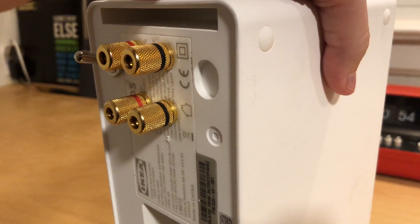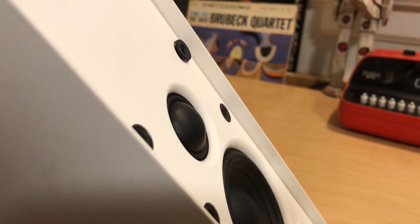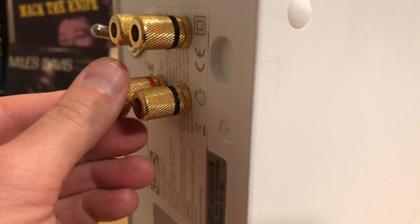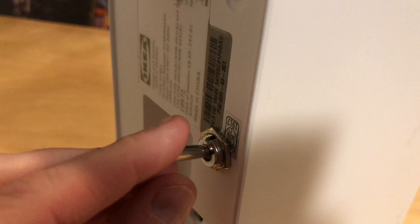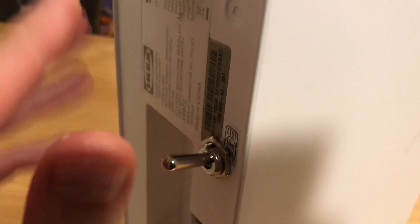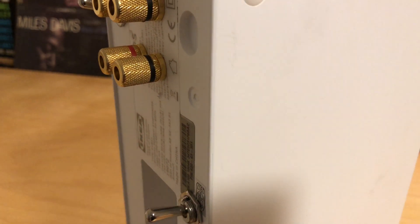To the left I wired in a DC switch. That switch lets me turn off the internal soft dome tweeter, completely disconnecting it, which allows me to use this essentially as an amplifier with an electronic crossover and skip the internal speakers entirely. Beneath that, again, we have binding posts that let me access the woofer amplifier, and down here I added another DC switch that allows me to disable the internal woofer. So these binding posts just tap off the woofer.